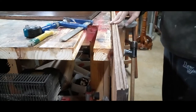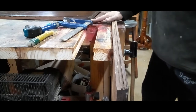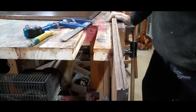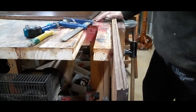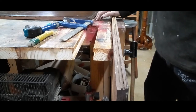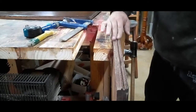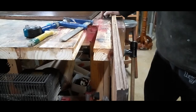I personally really don't like working with sleeper wood. I do this job because I've got lots of respect for the guy who owns this table — he taught me a few life lessons that I still live by up to this day, and that's the only reason I accepted this job. Otherwise I would have never touched sleepers. It's a horrible wood to work with — it never glues, it's always full of splinters, it's always too dry, and really hard on your machines. The glue basically didn't do much on this whole glue joint, and that's between all six planks that were in here — they all came loose, so easy, no effort.